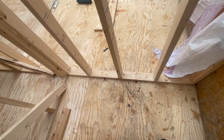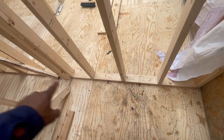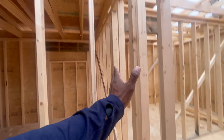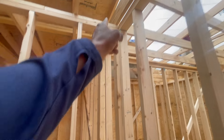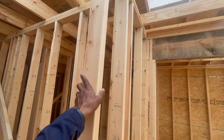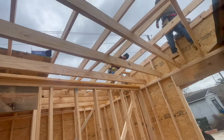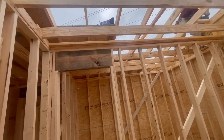We ended up doubling the flooring joist for this wall right here so that we can span this. This can carry this span up here from here to here — so those are two-by-sixes. These are ways that you can actually save lumber.